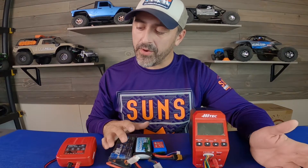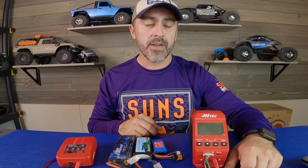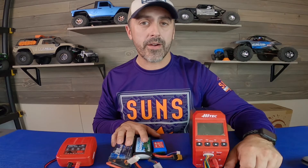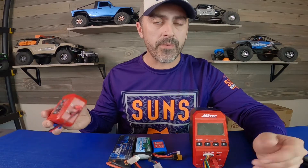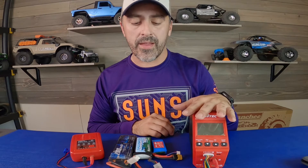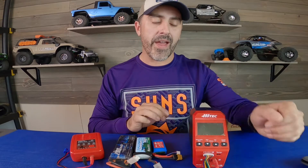If you're in the market for a charger or new to this hobby and just getting into LiPos, there's definitely some technical information you're going to want to buff up on, because they can be dangerous. This is a great little charger — one-button operation, it'll charge everything from a 2S, 3S, 4S pack with adjustable charge rates. This is a better charger in my opinion because it has a feature that allows you to put your batteries into a safe storage state.